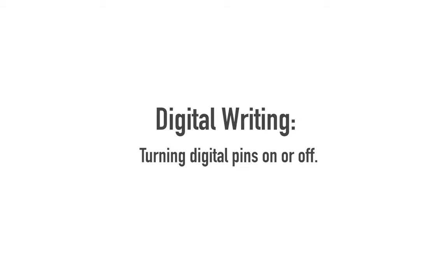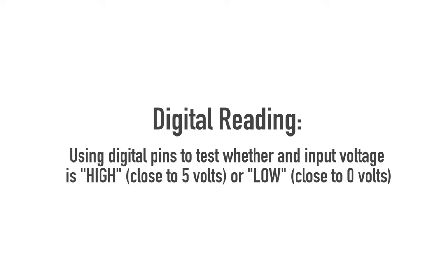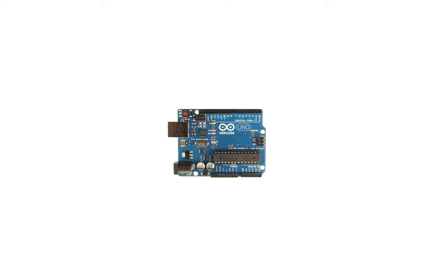The process of switching things on and off using our digital pins is referred to as digital writing. We'll go over that in the code in the next tutorial. As well as being able to digital write to these pins, we can also digital read from them, which means if we have something hooked up, like a button, it allows us to read its value. For example, we can tell if the button's been pressed depending on if the digital read is at 0 volts — not pressed — or 5 volts — pressed.